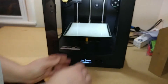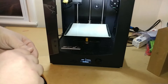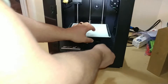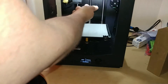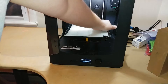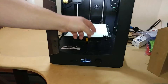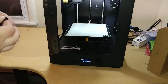You'll need to use at least two clips. I originally thought the silicone would hold the print to the build plate, and it does to an extent, but on large long prints I've had it actually move. One thing to remember about the clips is you have this fan area here that can hit them, so I usually don't put one back here because this fan section can hit it. Just be aware of the fan part actually hitting the clips.